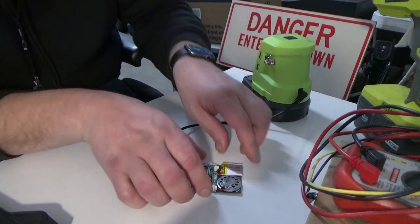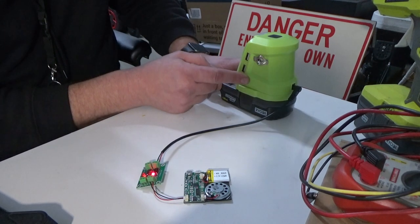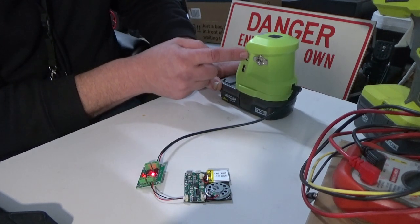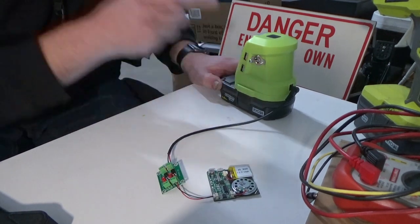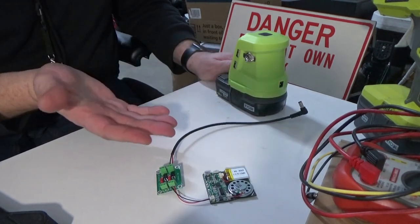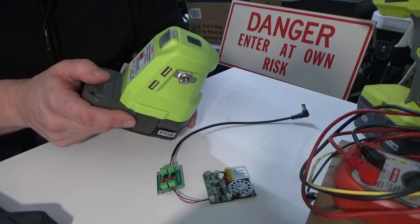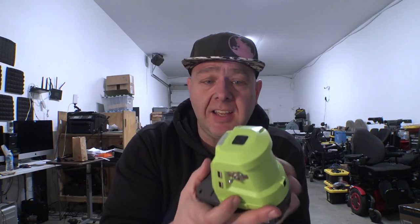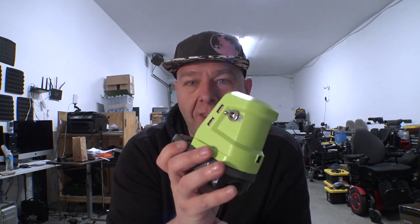As this thing turns off, our LED fades out — we've apparently got some capacitance in here storing power. I figured it out: I have these USB boards in line with this switch, so when I turn this off, the power from the converter and the capacitors is bleeding through and triggering it again, causing the double trigger. If I just unplug it directly, it doesn't trigger. Interesting note — I'll remember that when using this for testing. I'm also going to get one of those variable bench power supply things with a screen and voltage knob.